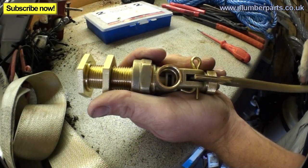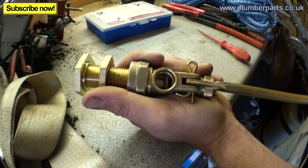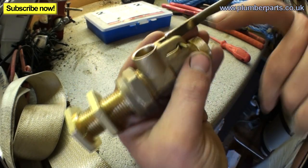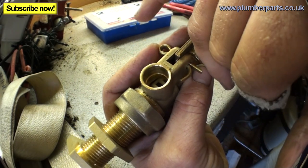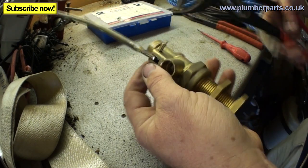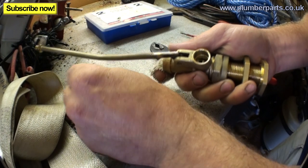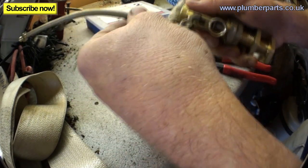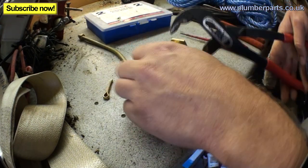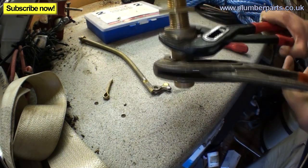The first thing you have to do - if you look inside here, can you see that moving in and out with that arm? We're going to take all this lot out and I'm going to show you how to fix it if it's leaking. First thing you do is this pin here has to be straightened and pulled out. Make sure you pull that out nice and easily. Put that to one side, look after it. Now this arm - the actuator arm - will come out. The next bit you want to do is grab this nut nice and tightly, and using another pair of grips, grab the body of the valve and undo this nut.